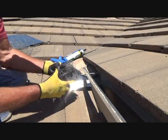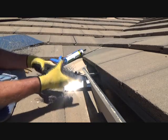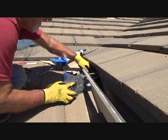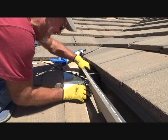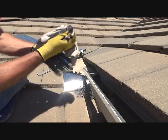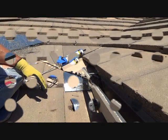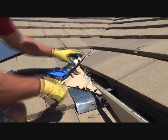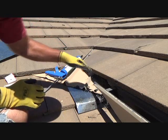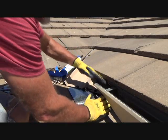I'm just going to fold the edges under and then kind of roll it up and flatten it down like there and push this down. I already got goop on my glove — I might want to do it without my gloves, but we'll see. Just keep finagling with it and get her under there. It's pushed the flashing on down, and it's also going to keep birds from going underneath there.